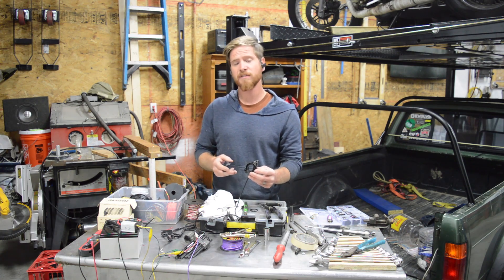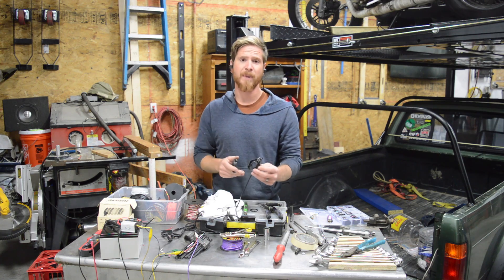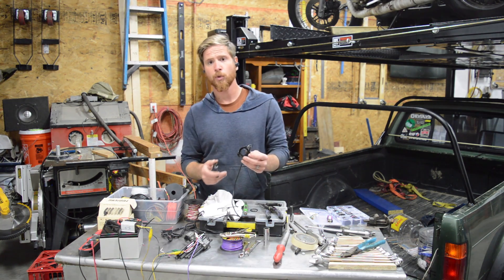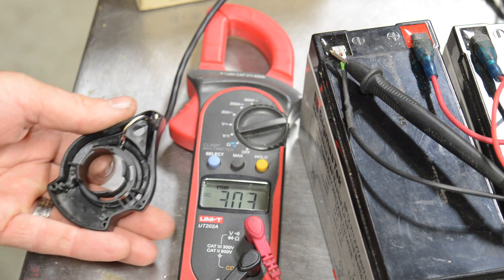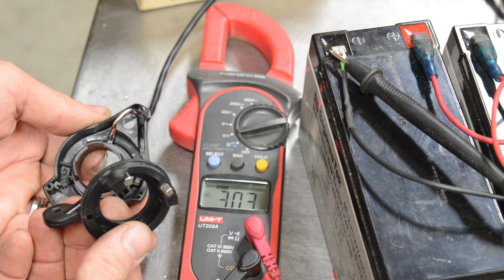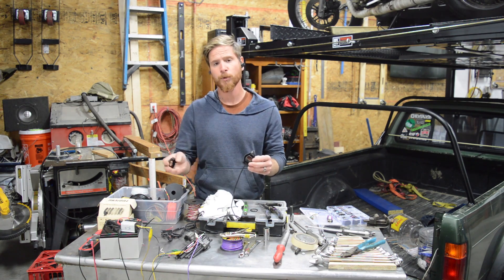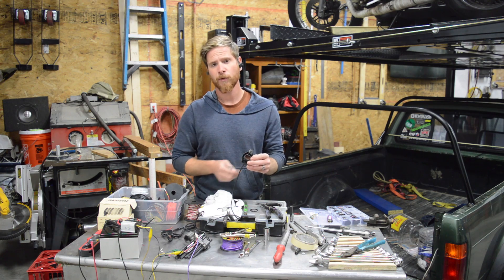What I'm working on right now is trying to control the forward, backward, and turning motion of the vehicle. The original toy had this thumb switch, and inside of it, as I pulled it apart, there's a sensor which seems to be a resistor that cuts the voltage in half. I'm putting six volts in right now and three volts come out.